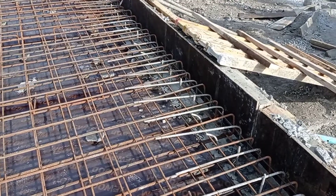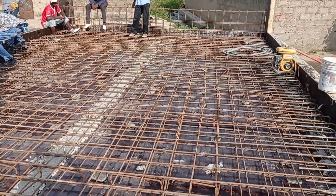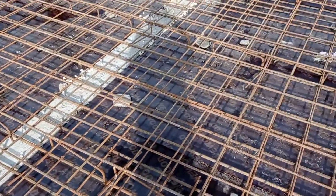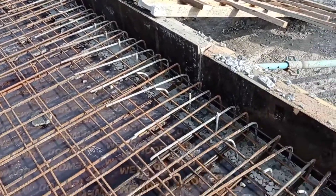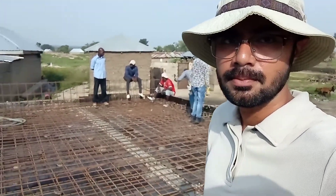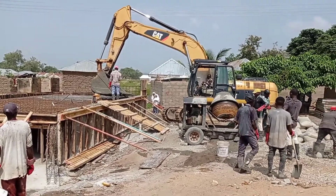You can also see that the biscuits or spacers have also been placed at the bottom of the reinforcement bars. These spacers are really important — whenever we are doing the construction of either a slab or decking, we have to make sure that we use these small spacers. Because by the time we remove the shuttering or the formwork, we would realize that the reinforcement bars can be seen if spacers were not used. These spacers help us to make sure that we get the concrete cover.